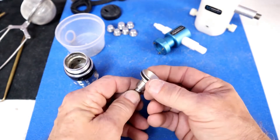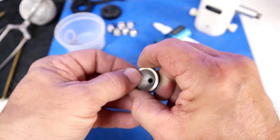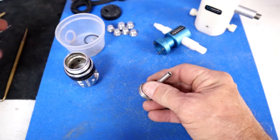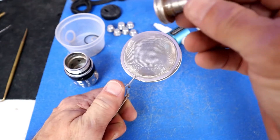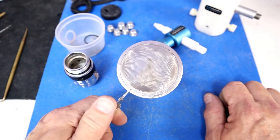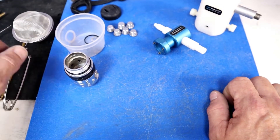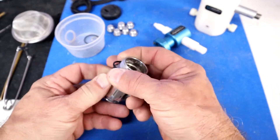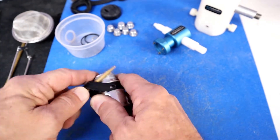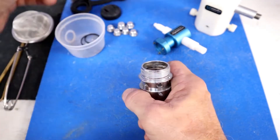On the base of the piston we have an o-ring — pinch it so I can peel it off. That gets replaced, into the cup. The actual piston I don't just toss into the basket; I put it in this little clamshell basket so it's protected inside the ultrasonic cleaner. On the body you have a large o-ring — pinch that and it comes right off. Next there's a large rubber seal that comes off and gets cleaned with soapy water and reused.